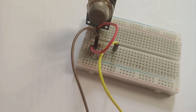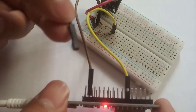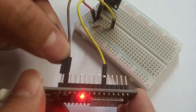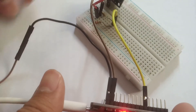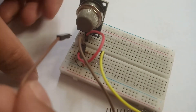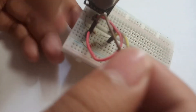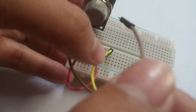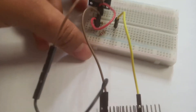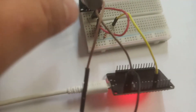The remaining pin is the VCC. I will take this last pin and connect it here. This should be connected to the very first pin from my right hand. There are four pins, and we will connect it with the fourth one — the VIN pin. You can see the circuit is now completed and you can verify it with the help of the circuit diagram.